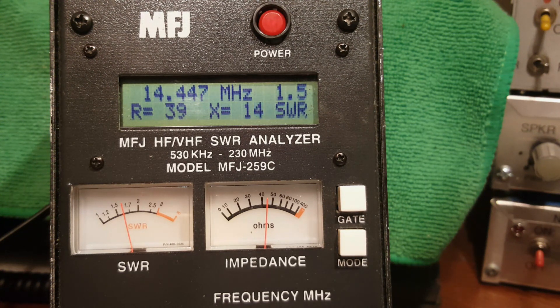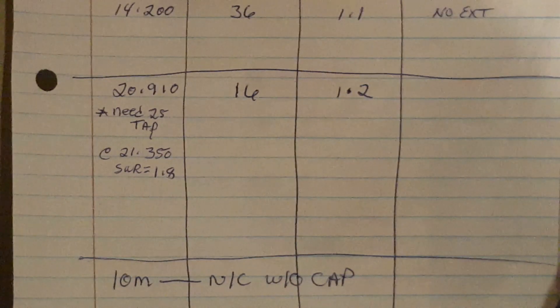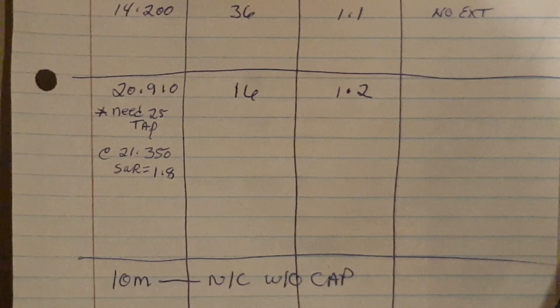I won't use a commercial antenna, and I won't use a trap or inductor in the antenna wire. I just want a piece of plain wire. And I don't want to use an internal tuner. My game plan is to get the antenna resonant higher in the band, then add a little extender clip to drag it down into the CW portion.